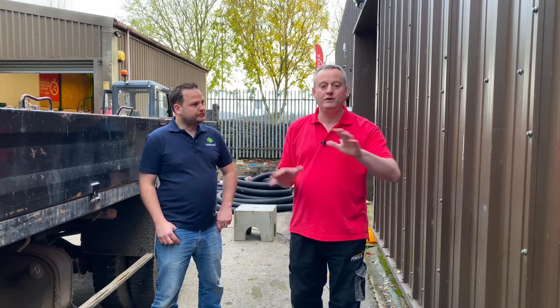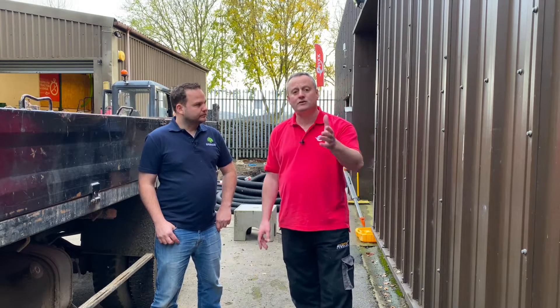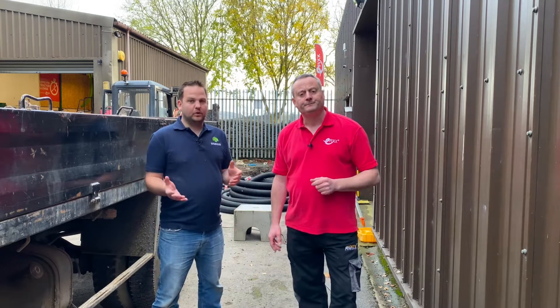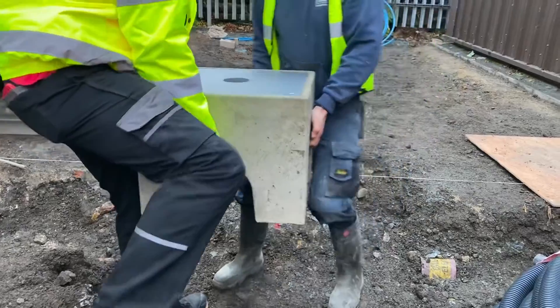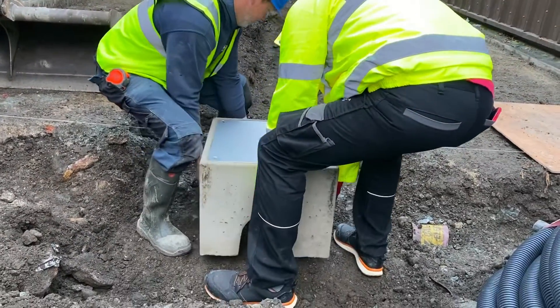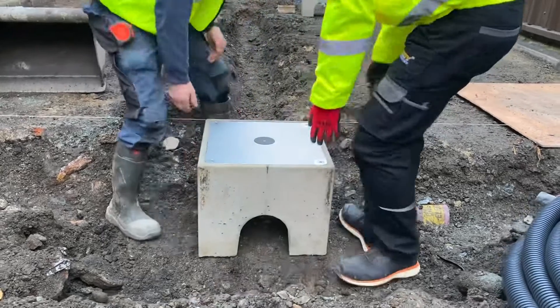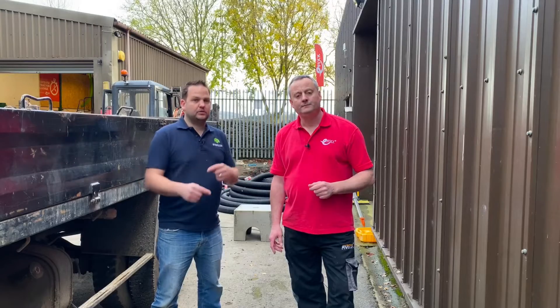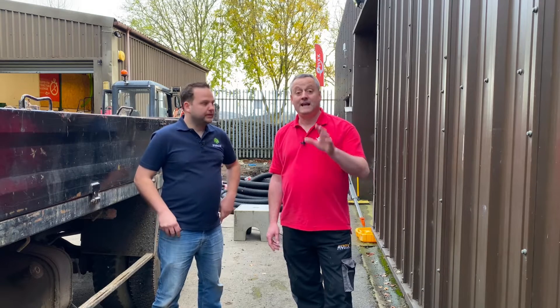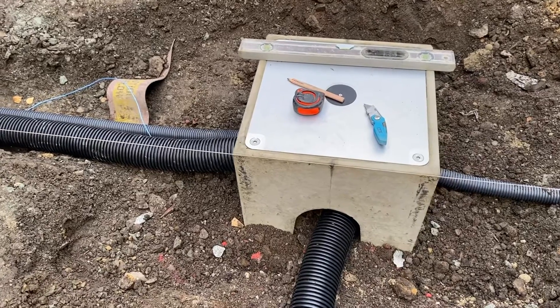That's going to speed up the process even further. When we last spoke, you were suggesting that people were doing the civils in advance — so in other words, they might be installing 10 of your EV blocks and using maybe five of them as EV installs. Are you still experiencing that? Yeah, absolutely. We're seeing that more and more as people are looking to adopt EV over a longer time scale. They'll take 10 blocks, fit five chargers, but they'll have those additional chargers later on in next year's budget or the year after.